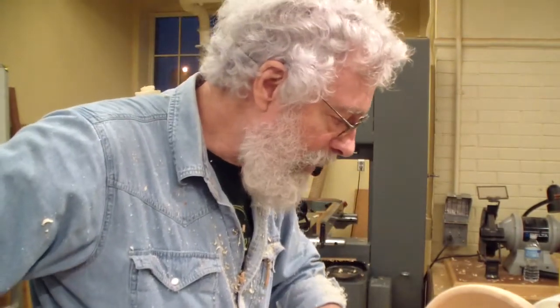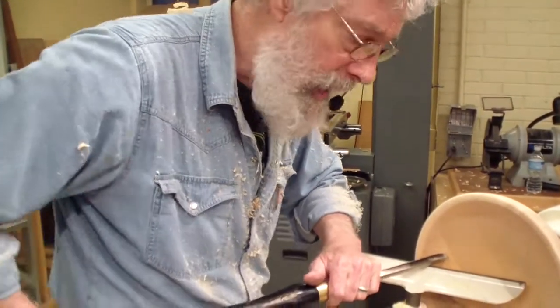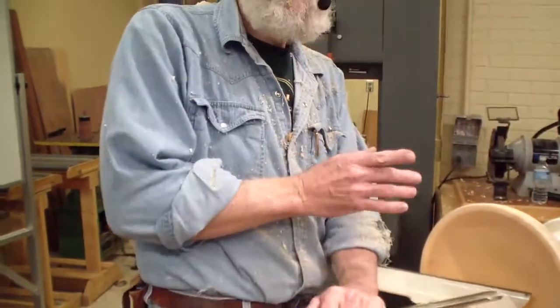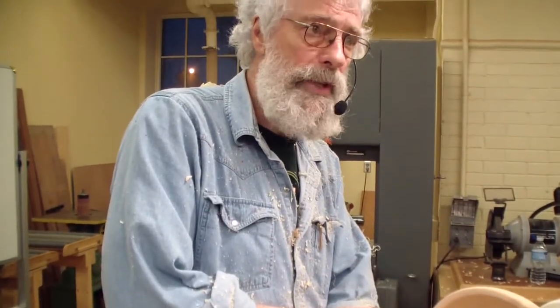So when I'm going through this cut, I want to be as mobile as possible through my legs so that I can move from vertical over this leg to vertical over this leg as I go through the cut. And if I can do that, then I can get these really nice volumetric curves going on with my forms. If I'm inhibited in some form, usually because my feet are too close together or my knees are locked, then I'll create a series of facets in order to be able to make the turn. And I'll simply have to sand those out.